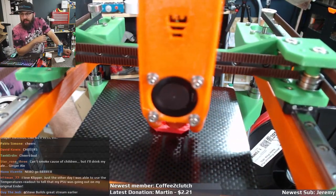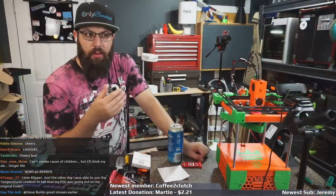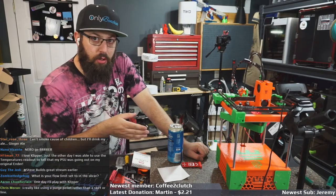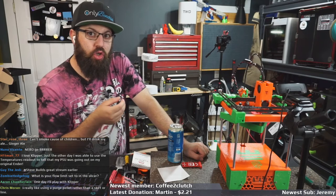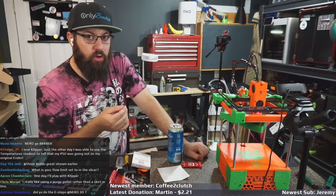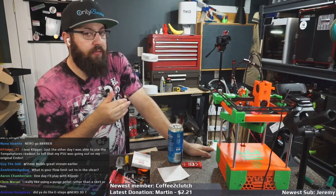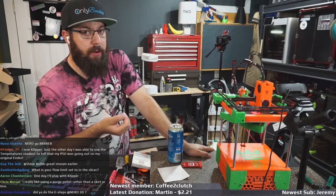What about the vid on the differences? The more aggressive the input shaper you run, the faster you can go without ghosting, at the detriment to rounder corners. The more aggressive of an input shaper you run, the more it rounds your corners. So a sharp corner becomes a rounded corner. So if your prints have rounded corners, you are running too aggressive of an input shaper.